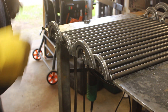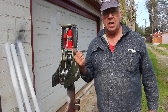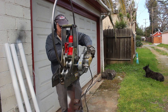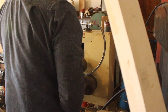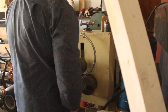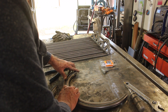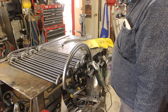We'll build the chair frame. The half circles of square tubing are working pretty well on the rest of it, so I think we'll continue with that same theme and make some larger half circles to create the final stage. The power roller was working fairly well but wouldn't get a tight enough circle, so I had to switch to another roller that doesn't roll as well but does make a tighter circle. There's our third level bearing. Now we need to mount that to a chair.